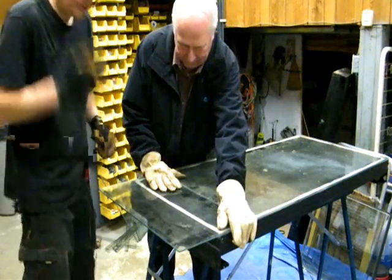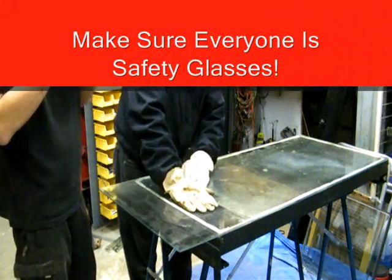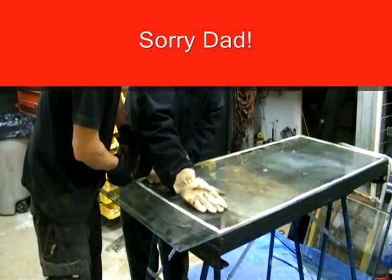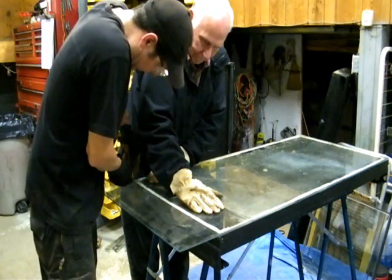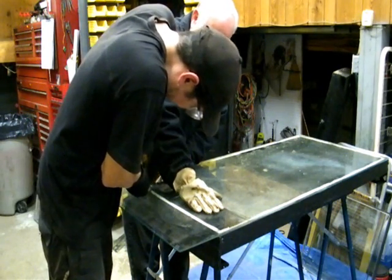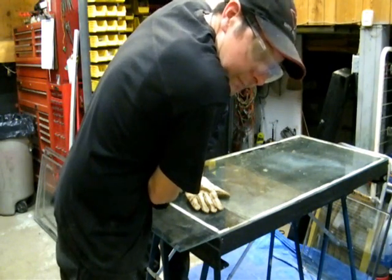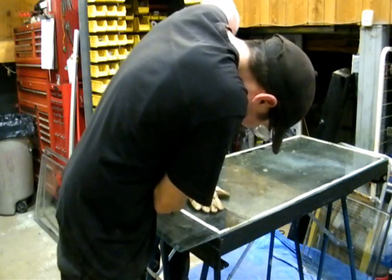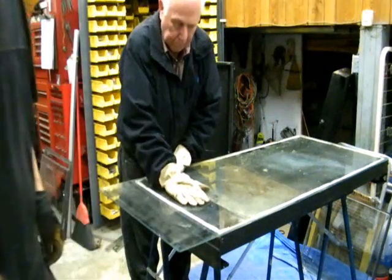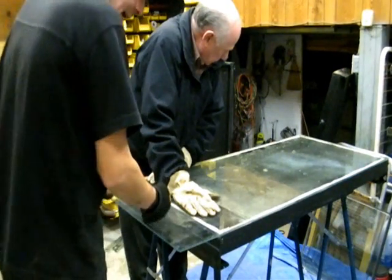You just take your glass cutter. Make sure you're wearing safety glasses and safety gloves — make sure you're all protected because you never know when an accident might happen. Then score it across here. You want to have a consistent sound as you go. If you have to pause, keep even pressure on it. So there we go — that's the scored line. I had to veer up there at the end, so we'll see what happens now.